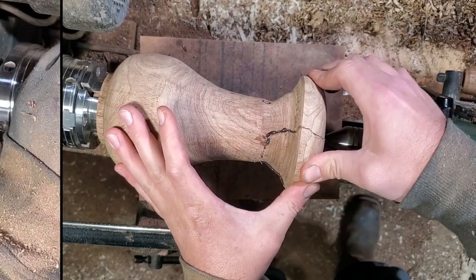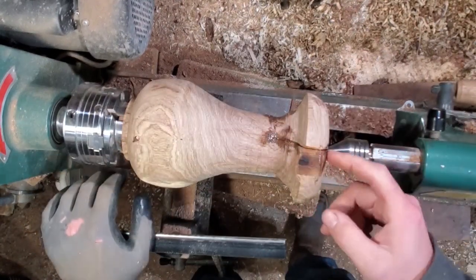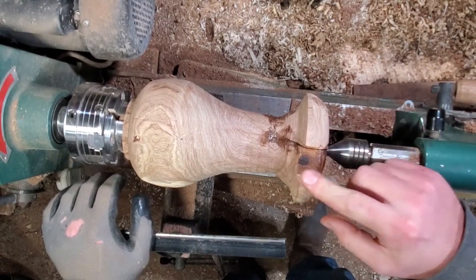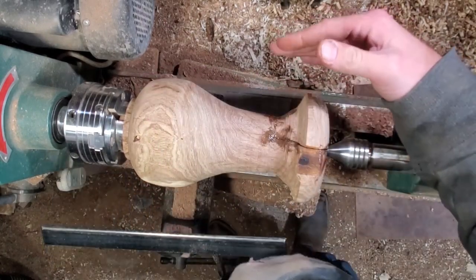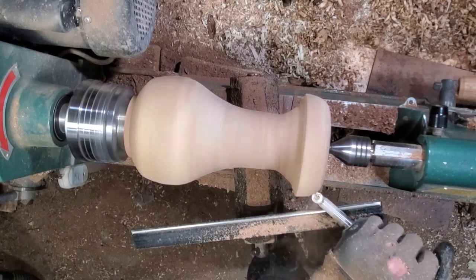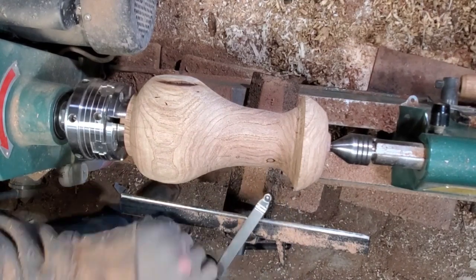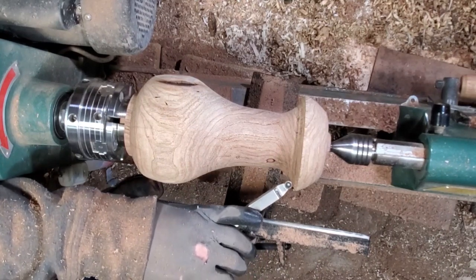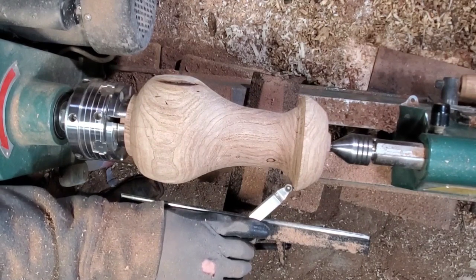All right, we got the piece back on there. There's still a chunk missing on this side, which is no big deal because I planned on turning this down smaller anyways — I don't like it when the top is as big as the base. I'm going to try my smaller carbide coming at more of an angle, for two reasons: I'm going to concentrate on turning this very lightly like I'm turning end grain, and it keeps me the hell out of the way.